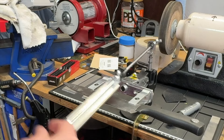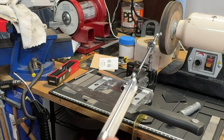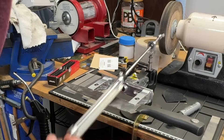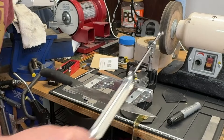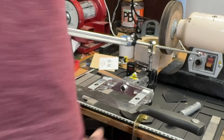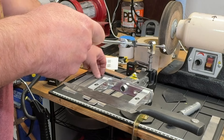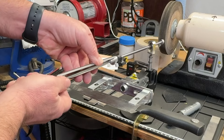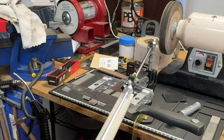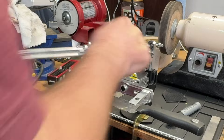Someone was asking about strokes on the TS Prof — it's best to do a full stroke and use as much of the stone as you possibly can, rather than little tiny circles. I'm going to grab my 1000 grit stone now and finish on a 1000. Another thing you can do every so often is flip your stone around to make sure you're wearing it evenly at both ends.